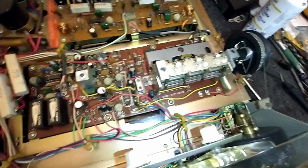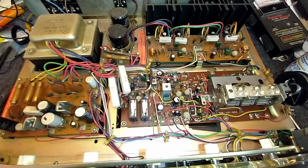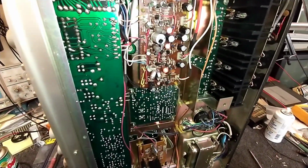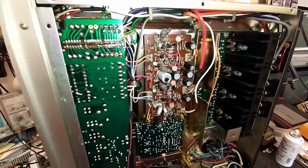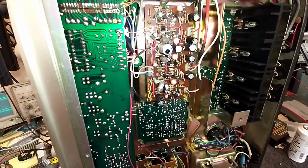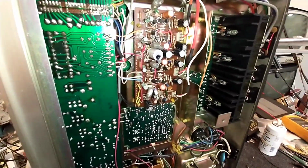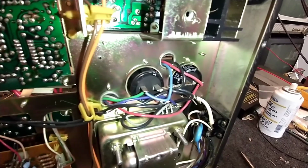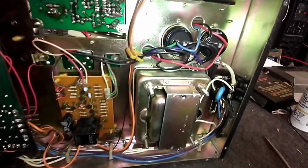Yeah, just looking around this thing, this is not a cheapie. Let's take the bottom cover off and hope that the electrolytics haven't peed. Alright, here's the bottom side. We got a fairly complex phono preamp here. Wow. So we got like what? 10 transistors for a basic RIAA preamp. Pretty decent build there. We've got our DC detection circuit down here. Decent sized bus bar has been properly soldered. No bulging or peeing capacitors, that's good.